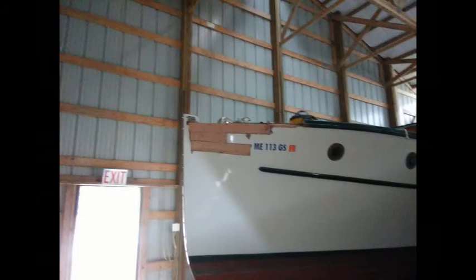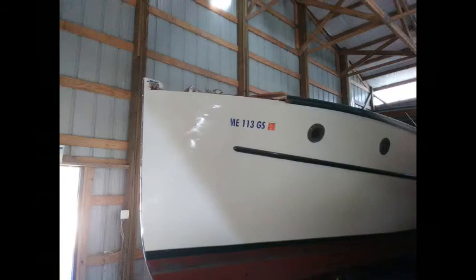I don't have pictures for the other repairs because they're on the other side of the boat — I was working in about an 18-inch space between the shed wall and the boat and simply couldn't get the camera far enough away to get decent pictures. Once the new wood was in place I sanded everything fair, then put in some fairing compound on the ends of the scarves to get rid of any unevenness, caulked the seams and puttied them. When that was done I sanded everything again and put the first coat of new paint on the hull, and the following pictures show the result.